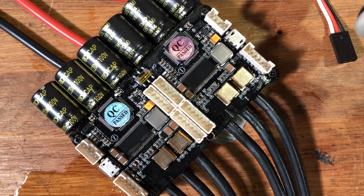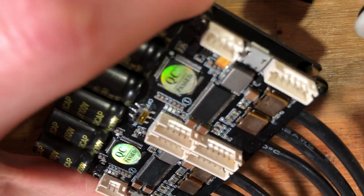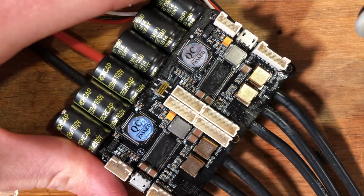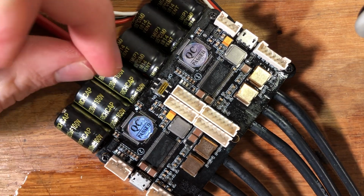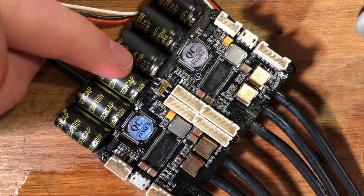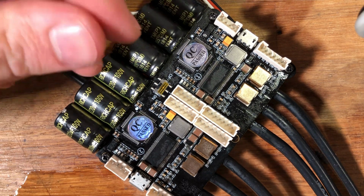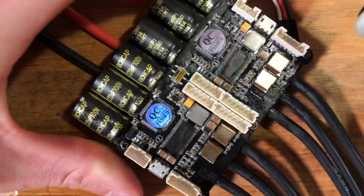Then you need to cover it with some heat shrink, or I guess you could use some packing tape or whatever, just until you get some new heat shrink. But ideally you want heat shrink so it can handle the high temp. Kapton tape would work as well, but it will get gluey and messy and nasty. But yeah, that's basically it.